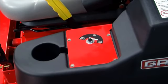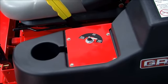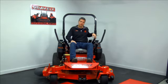As you look to the left side of the cockpit on the dashboard, we moved the fuel valve switch that was previously located behind the operator. Obviously, very difficult for the operator to switch on the go, over on the side. So this fuel switch allows you to switch fuel tanks from the left to the right side. And our fuel tanks carry 13.4 gallons of fuel combined. So as you run out of one fuel tank, you can adjust it right from the control cockpit to the other tank.